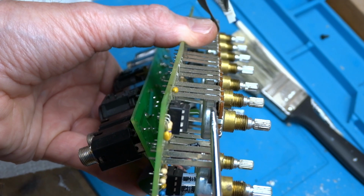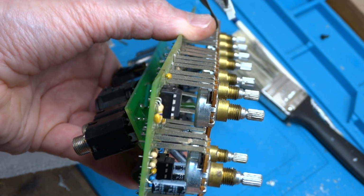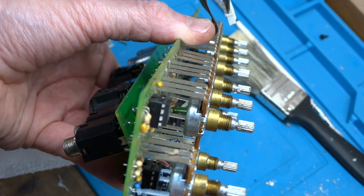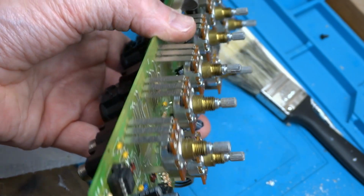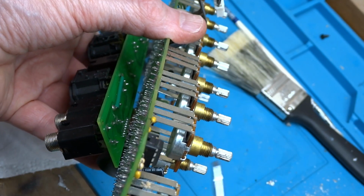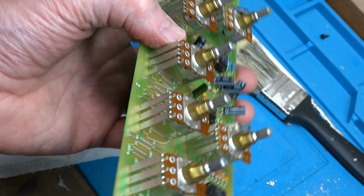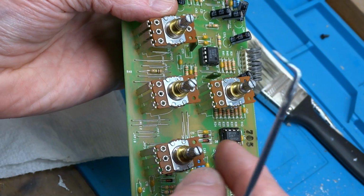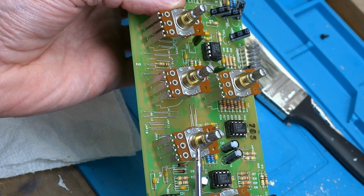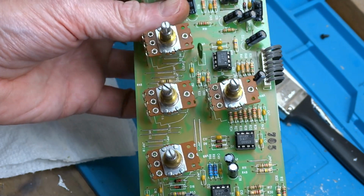So when you spray in there, you want to get it in there and get it soaked really good, and then we'll turn the knob and spray it again, like I said. I've seen people spray it on the back. Deoxit even makes a thing that you screw onto the shaft, and it'll force the Deoxit down between the shaft and the collar there, which can work.